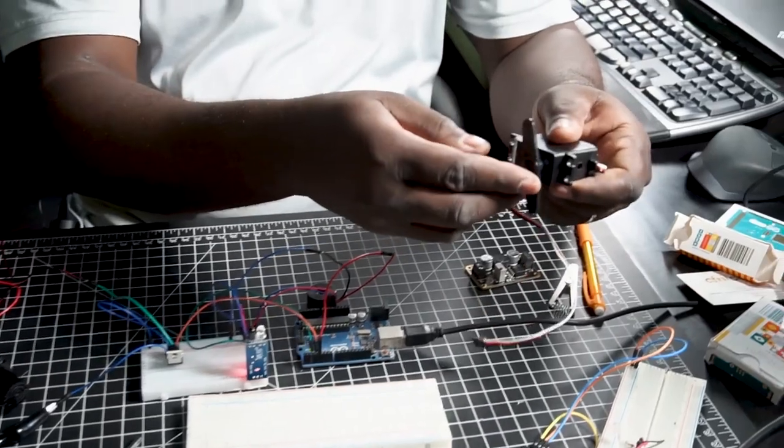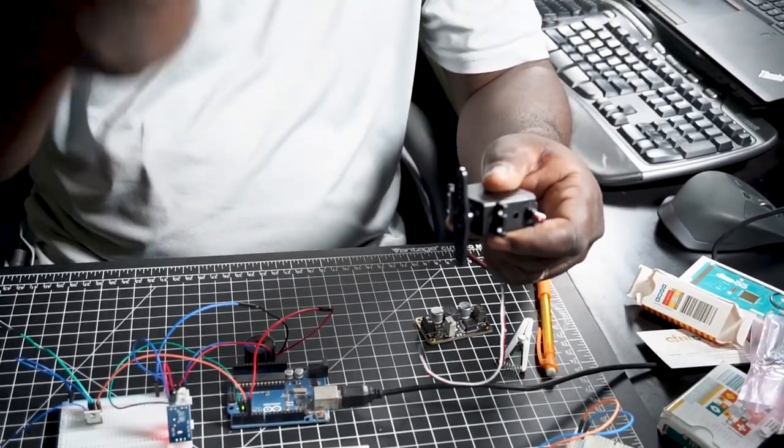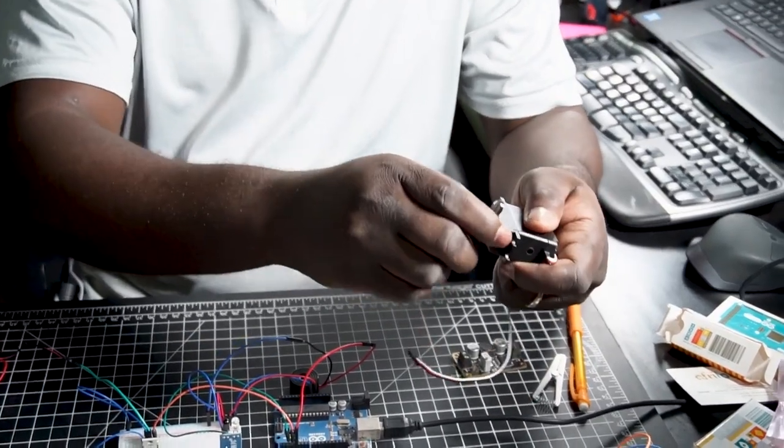The programming took probably an hour or two to figure out. One of the problems I faced early on was using an IR sensor — an infrared sensor — which was sensitive to infrared and didn't work well outside. If we brought the system outdoors using the infrared sensor, it would not work properly; we'd have to enclose all the sensors in a box to prevent light from coming in. That's why we switched to the ultrasonic sensor, because that works in pretty much any environment. The other challenge was with the servo — a continuous rotating servo. Setting it up was tricky because I had to figure out the midpoint so it would rotate in the direction I want. But apart from that, it was an interesting build with lots to learn.